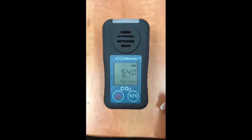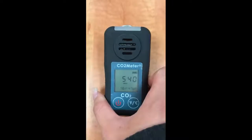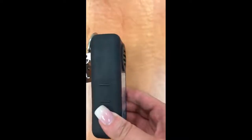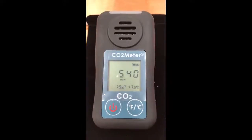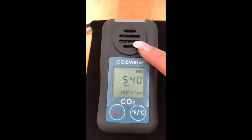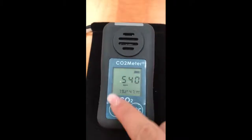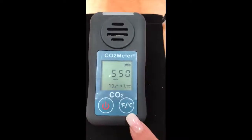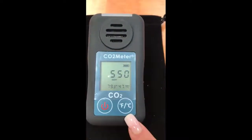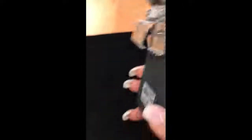Now let's look at our SAN-10 features. The SAN-10 features audible, visual strobe, and vibrating alarms. It also features a man-down alarm which leverages accelerometer technology when a person has fallen down. It includes an NDIR sensor to provide long-term stability. It offers a visual alarm and strobe, a front-facing sensor, a charging indicator, a large LCD display, a power button, a temperature unit button with dual calibration methods for ambient air and nitrogen, a USB charging inlet, a heavy-duty metal clip for industrial use, and a reset hole.